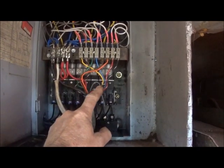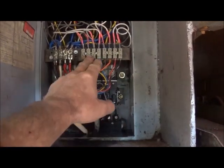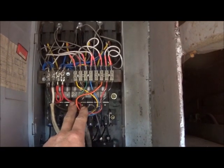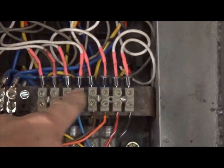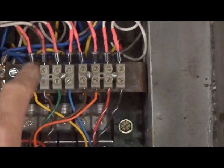So you've got the black wire, white stripe, red wire, white stripe blue, yellow, orange, brown — all eight of these are functions. The power runs from our box through our functions up through here, and then I've got a diode on each one. The diode is just to keep anything from back-feeding through — we don't want any problems with our box up there. It's recommended, not required. A diode is like a one-way valve for electricity, and you won't regret putting one on.